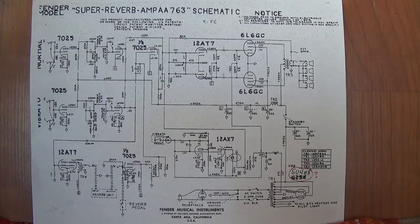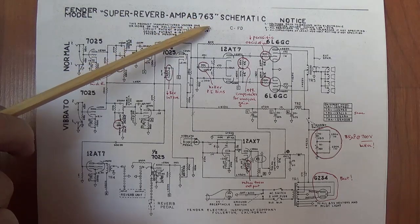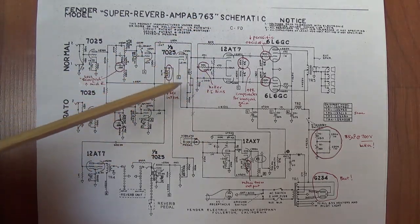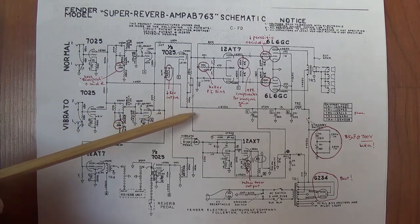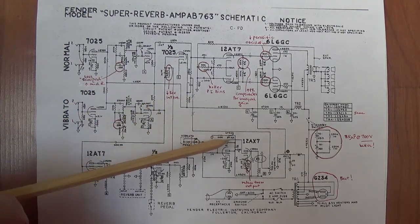The AA763 really doesn't seem to be all that common. I think almost immediately they revised it into the AB763 version that we are more familiar with. So let's take a look then at the AB763 that has the important revisions and that we will accept as our golden standard for the Blackface Super Reverb circuit. Here is our AB763 circuit schematic. As we will see, there were about 7 or 8 revisions from the AA version. We're going to go through and discuss each one in detail, and I'll also try to explain why the revisions